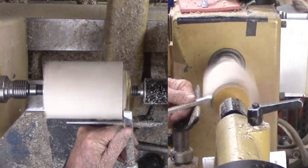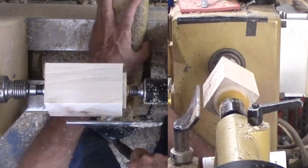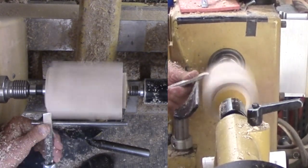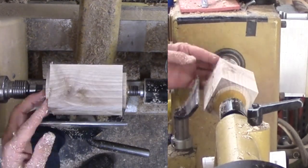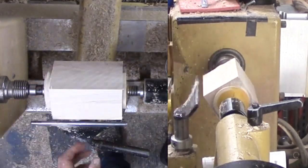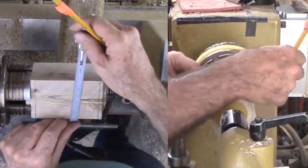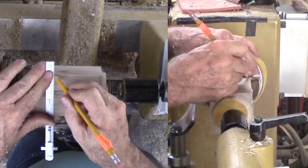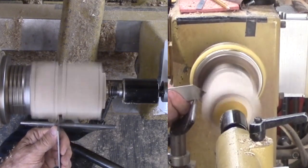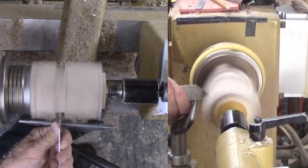No rounding, but I still need tenons. Since there will be excess wood on both ends, I don't have to be careful to avoid splintering. However, later this splintering could be disastrous, so I take the opportunity to practice while cutting a tenon on each end with my skew. One tip I observed from Pat is cutting a mortise and tenon for this box. Normally I would part off the lid from the box, but instead I am reducing the diameter of what will be the joint's tenon. Then, when this is at a good diameter, I shift away from the lid section just a trifle and part it off there.